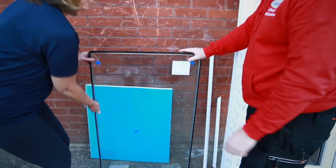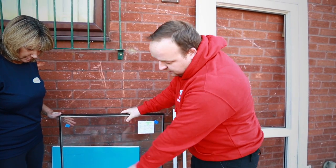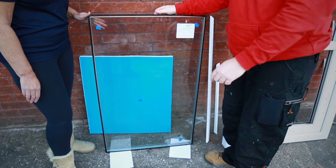Grab your glass. When you're dealing with toughened glass — always toughened glass in the door — when you're putting it down, make sure you're not putting it down on anything hard on the corners or anything like that, because it will just pop and smash the glass straight away.